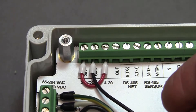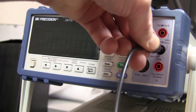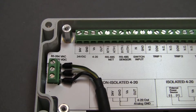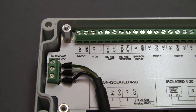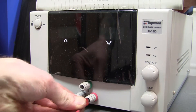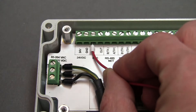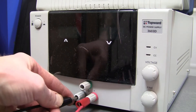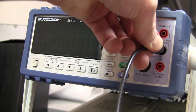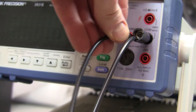The 24-volt ground terminal will connect to the meter ground, and the 4 to 20 out terminal will connect to the meter's milliamp input. If an isolated 4 to 20 output circuit is desired, simply connect the positive wire of your 9 to 28-volt DC power supply to the VS terminal. The negative power supply output should connect to the ground on the meter. The 4 to 20 out terminal will connect to the positive milliamp input of the meter.